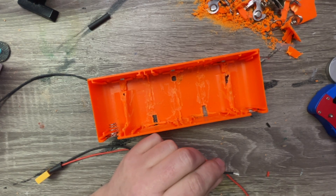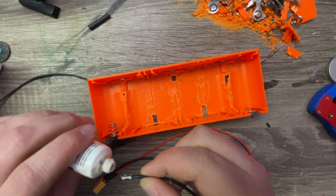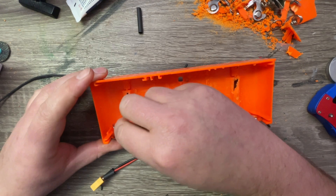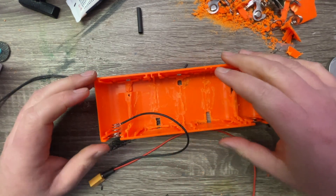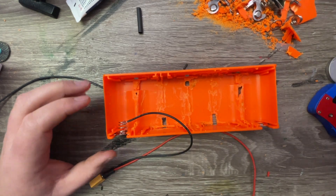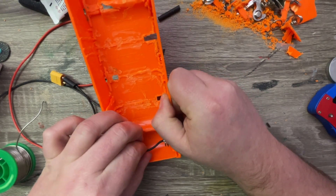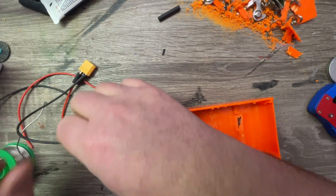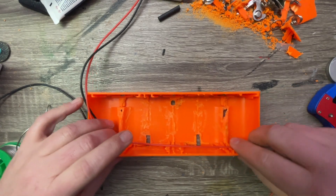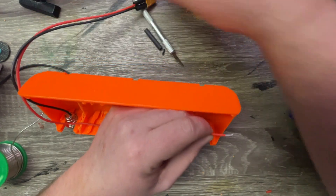Make sure my iron is nice and hot — sometimes your soldering iron will cool down if you're not using it, so you just need to make sure it's hot because you can't solder cold. Now I want that kind of in there. I'm going to solder that in just like that, kind of tuck that in between there so that there's a little physical connection. I got some flux on there. That's pretty good there now. Not my cleanest work, but it's fine.